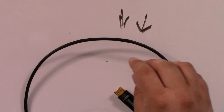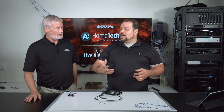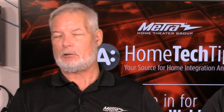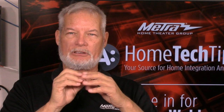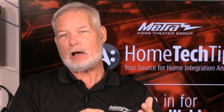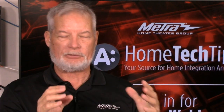What this is doing is causing resistance inside the cable, and because it's glass, you get micro fractures. When this happens, the glass will start to shatter and get little fractures. The common call we'll get is, well, I'm only getting 1080p, or I'm not getting 4K 60, or I'm not getting HDR. What is happening is the glass is no longer perfect. There are tiny fissures inside the glass, and that's allowing the light to diffract in directions we don't want it to, so it's not all getting from point A to point B. That's how we get a pretty good idea that when it was pulled through the house, typically around a 2x4 in an attic or over a header down into a wall, they were pulling hard and putting pressure on that glass and causing it to fracture.